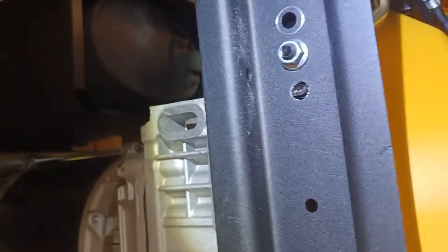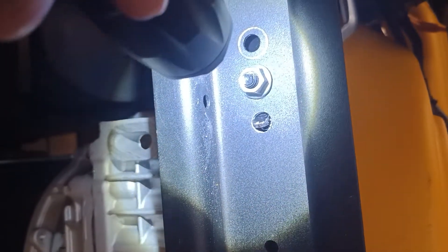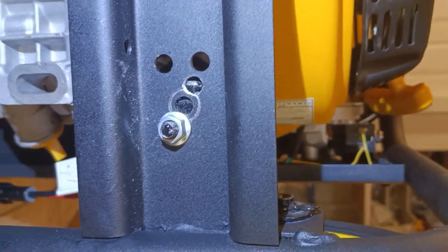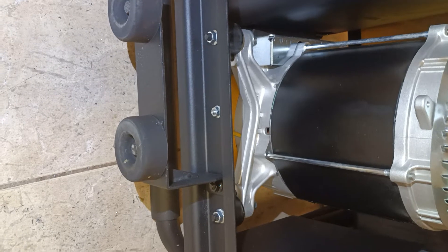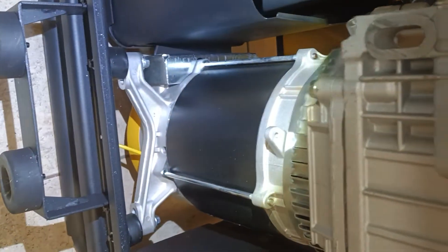Correction: the hole size for both the hook and the bolt is three-eighths, so use three-eighths for both of them. This one I had to push a little bit to the left — it was slightly crooked. It came in a little close to the existing hole but it's stable — it's going to hold, and it has four points. I used a 12mm tool to do so. I went ahead and tightened those on top, and now I'm going to tighten those on the bottom as well. I left it a little loose — almost hand-tight — because I didn't want it to stand crooked.